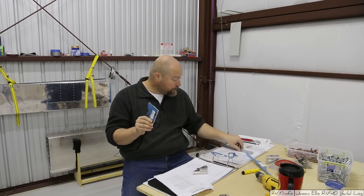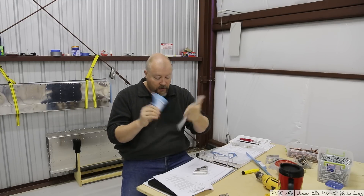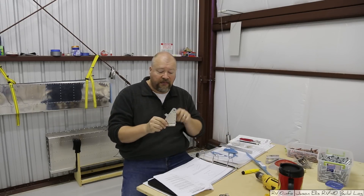This has a flange bend that's all part of a single piece — that's where the cracking is showing up in this flange. Instead of that, they've issued a two-piece which is the same thickness, and then you create the flange out of a much thicker piece of aluminum. The thing it does not come with — and this service bulletin kit was pretty cheap, I think it was like 50 bucks — is this bearing that's in here. So you have to harvest the bearings from these pieces.